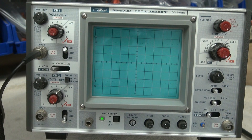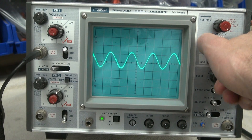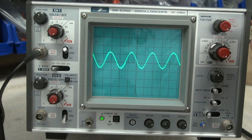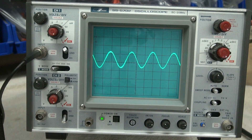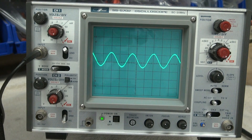So this amp needs some help. I'm not hitting her hard at all. I'm at 50 millivolts per division, so I'm only seeing like 150 millivolts, and I'm almost at full volume. You can see you've got some dirty controls, a nice sine wave otherwise. You see that wavering in the sine wave? That's an indication of a bad filter cap. But this 20 meg scope — that's all you need to fix that Champ.